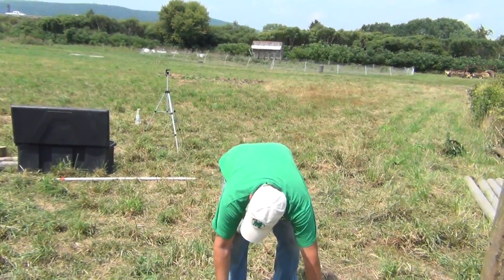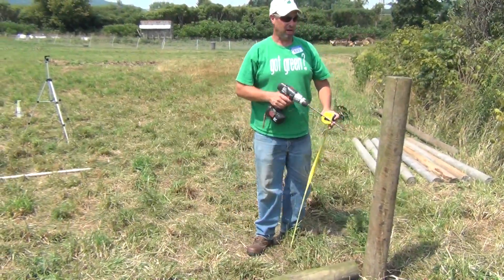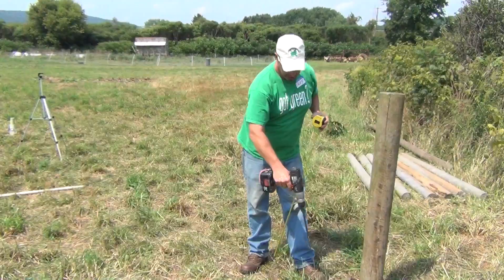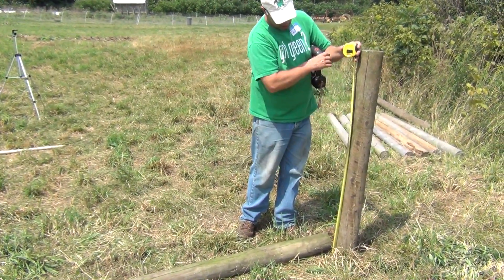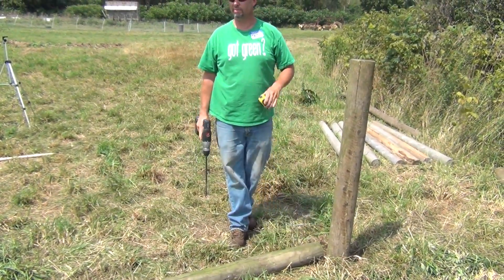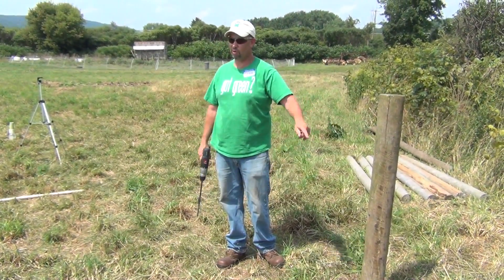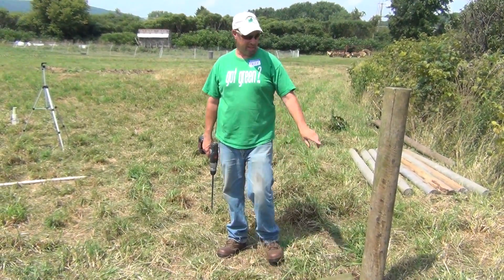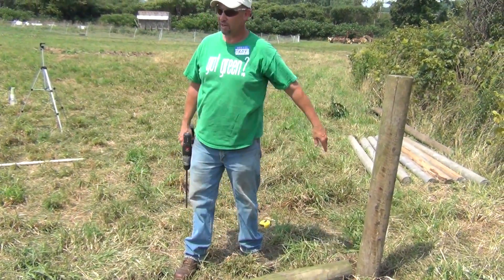After today, all I want you to remember is that on an eight-foot, ten-foot, or twelve-foot brace system, generally this hole will be 40 inches. Because in my entire 20 years of fence building, it's always been 40 inches, give or take — 42, 38. The geometry says that's where it ought to be to put six strands of high tensile on it.